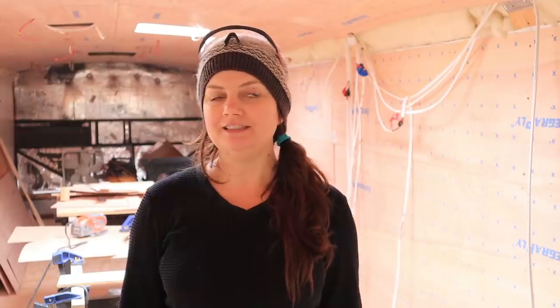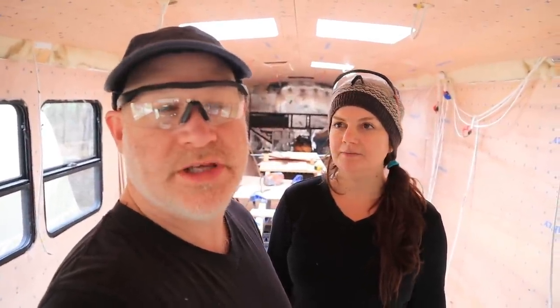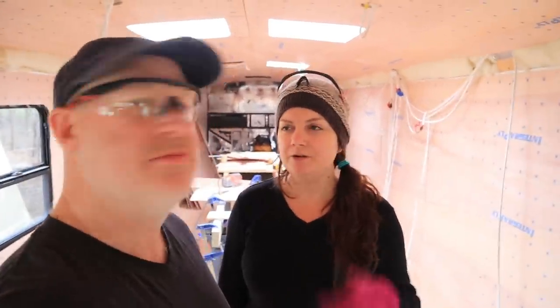I am a perfectionist so it's hard for me to look at some of the seams and round corners that aren't perfect. I know everybody's already told us when we started cutting walls we're never going to get it perfect — fill it in with caulking and all of that. Pick a spot, fill it in with some caulking, let it dry, sand it, and paint over it. See what it looks like. Or if we're not happy, just get some wainscoting to cover it. I've seen a lot of people use tongue-and-groove on their walls too, and I can understand why now — it would definitely just hide all those seams.